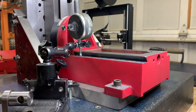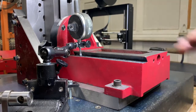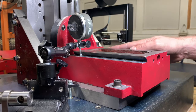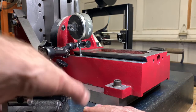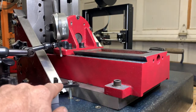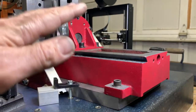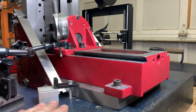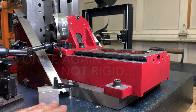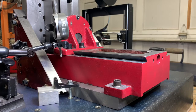I zeroed here — this isn't perfectly flat, but the first thing I'm going to do is take this side down. I have this mounted on a granite surface plate and I also have it clamped down on both sides, so it's on a flat surface. That's good for measuring height because I can slide around and I know I'm not introducing any twist into anything. I'm going to do some scraping — that's where we're at with this project right now.